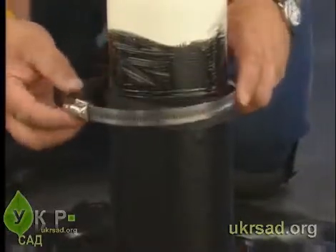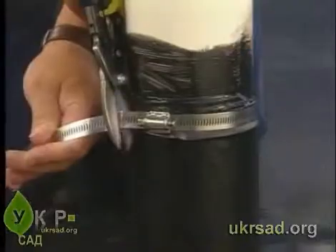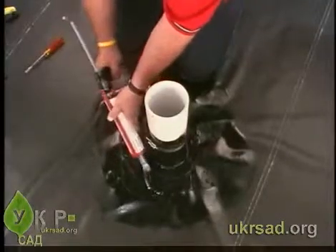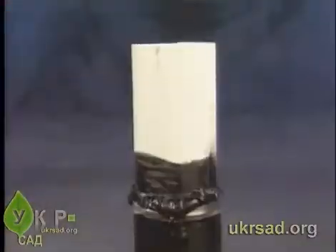Place the clamp over the form flash and tighten it. Cut away excess metal. Apply a continuous bead of Lap Sealant HS or All-Purpose Sealant to the top edge of the boot and over the edges of the base of the boot.